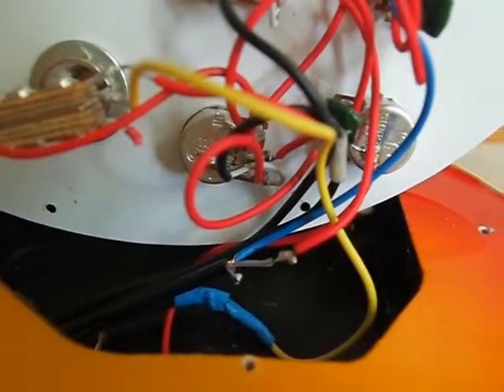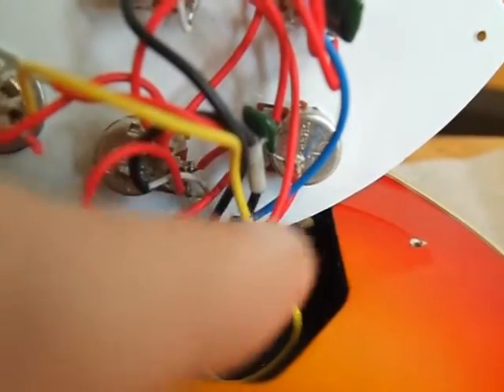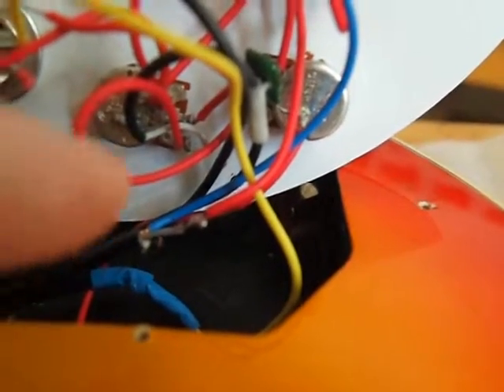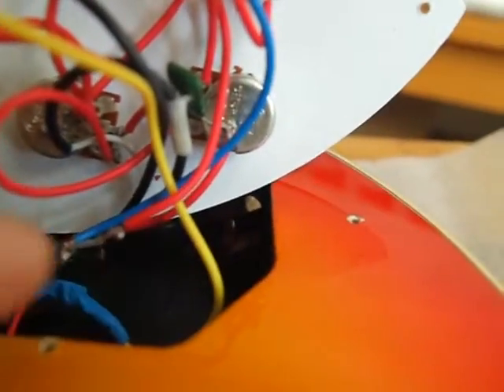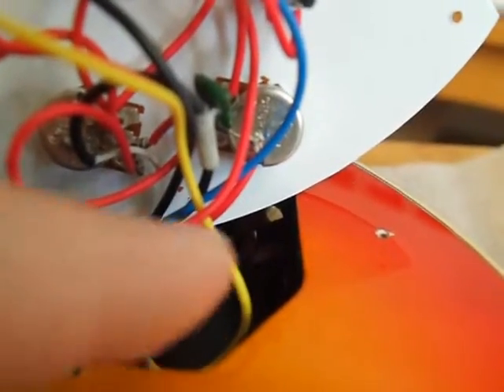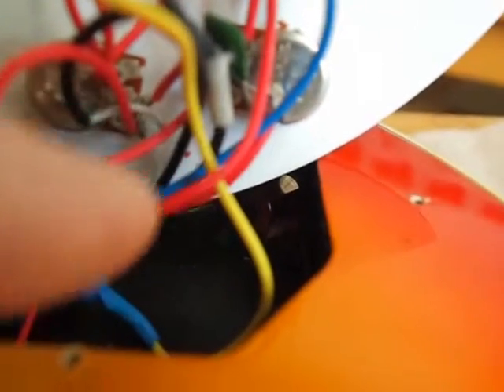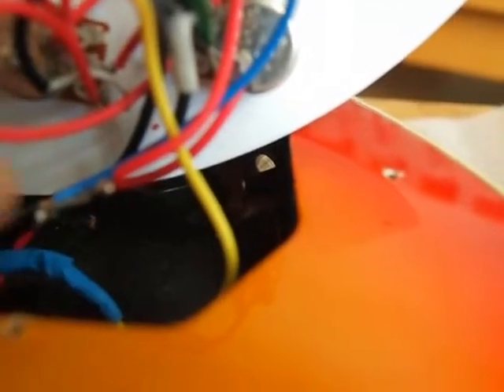It's quite simple really. You see where this red wire and this yellow wire cross over — these just need to be crossed over here. If we unsolder it over here and cut the yellow wire over here, we can do a fairly neat job and actually make the wiring more tidy than before. This is just swapping the two outputs — this output and the output from the switch — to the different channels. That's all it is.